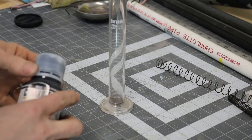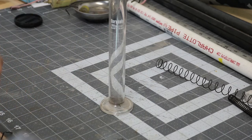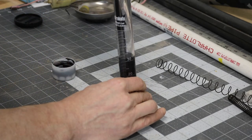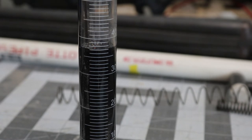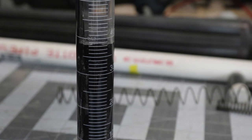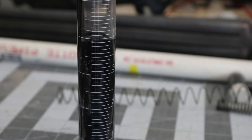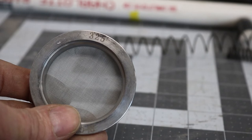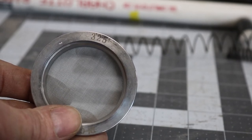For this project I'm going to take the E100 and mix up 36 milliliters. I know it looks like 37, but since there are air bubbles and a little bit of surface tension pulling that up to 37, it is actually 36 in there. Because we want to mix it 18 to 1, that means we're going to add 2 milliliters of Hardener - one and two. Now we'll mix that up and we'll be ready to spray. Elite Series Cerakote calls to be strained through a 325 mesh filter, so make sure you have the right equipment before you start mixing the paint.